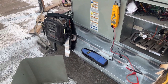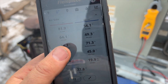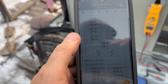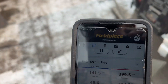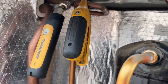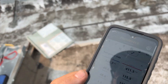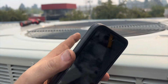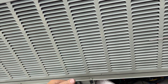Now we'll check our refrigerant with a clean filter in there. Our temperature is about 28 degrees right at the coil. Our head pressure is actually kind of high — and that's on a liquid line, not the discharge. This unit has a real liquid line hookup, which is nice. Another indication of high head pressure: I can hear the airflow fluctuating — it's going whoa, whoa, whoa. That tells me the coil is probably plugged.